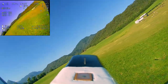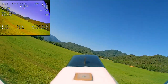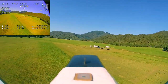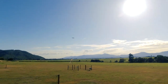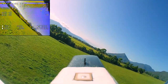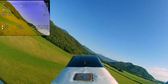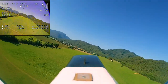I've double-checked all the wiring with the video feed and the VTX — everything's solid and good. All I can assume is it's bad filtering. I've got a capacitor coming, and I'm going to put one on the battery side of the ESC and probably another one on the camera side as well, just to try and filter the picture coming through from the VTX, and see if that helps.